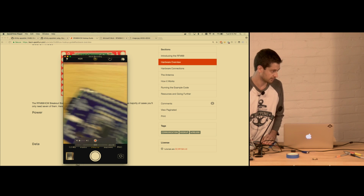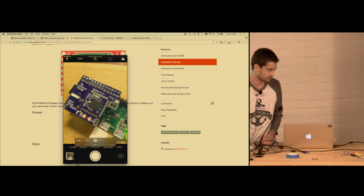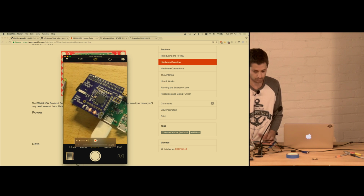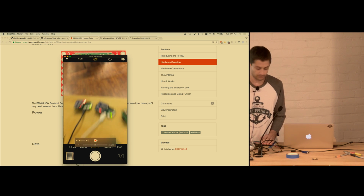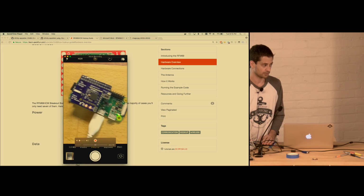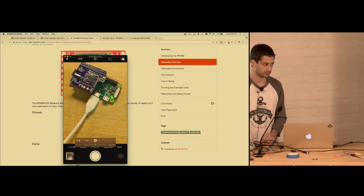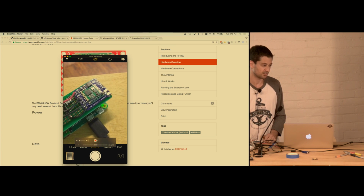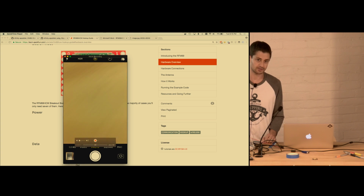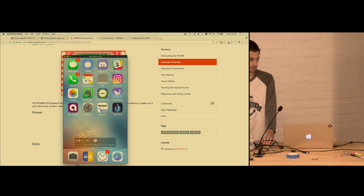I've also got these other ones that are Texas Instruments chips. They're a lot harder to come by just because they're harder to integrate. They're tiny, so most people are going with the RFM-based breakout board. But the cool thing is that this one takes a special firmware that you have to flash onto it, with the packet format and everything it has to know about talking to insulin pumps. The other one, this RFM chip, is almost infinitely configurable at runtime. So there's no firmware that you ever have to load on it. You just have to configure everything at runtime, which also makes it a little bit harder to deal with from code.